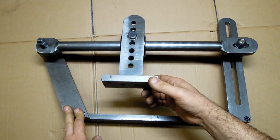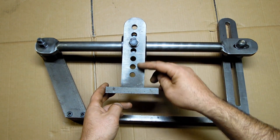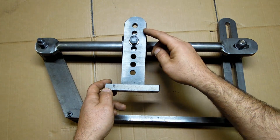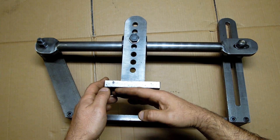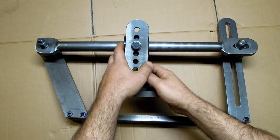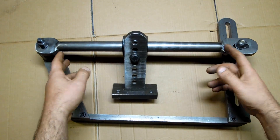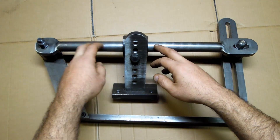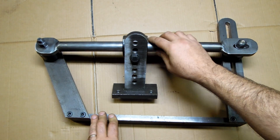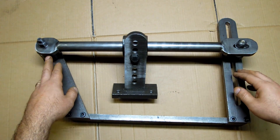The second part is just this little connector bar — let's call it essentially a drag linkage. It's full of holes, probably more than I needed, but I didn't really lay this out; I kind of built it on the fly, and I didn't know which would coincide with the cross slide. Maybe that'll make more sense when we hook this up. This just has a big bronze bushing that allows it to slide across the guide bar.